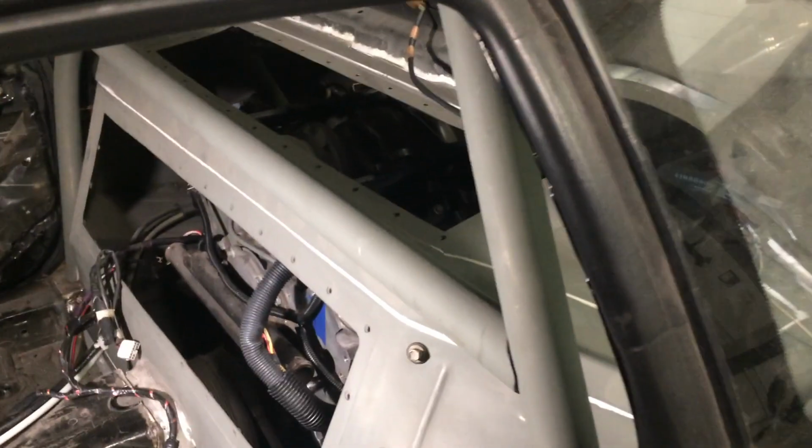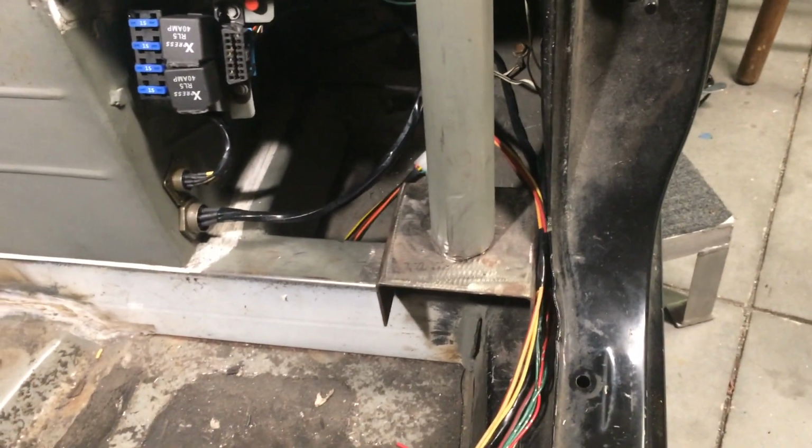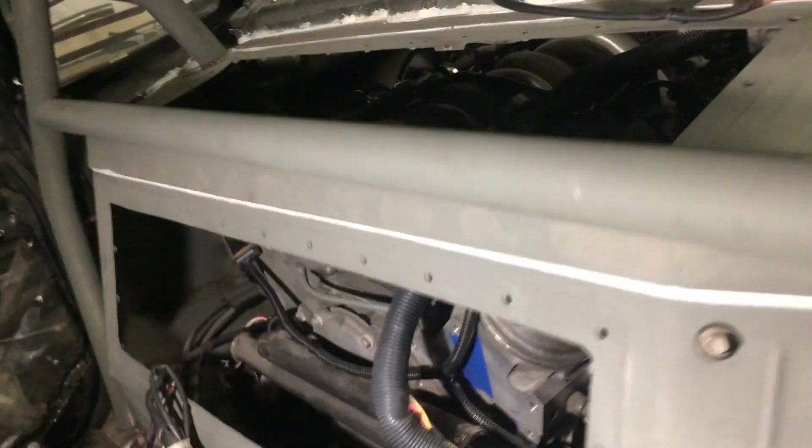So this is it. Now we're going to walk this over to the car and we can start taking our measurements. So just to recap, about a year or 2 ago, I did the actual roll bar in here, and it comes all the way around, and I didn't have the tube bender to finish the rest of the cage. So now that is all in there, it's not fully welded yet, because I'm going to come back and do that all at once. But as you can see, it drops right in. It is on the cage boxes, which are just not complete yet. And I have down bars go into the frame, which also triangulates into the shock towers on the rear end of it. So now we're going to move on to putting the rest of it in.